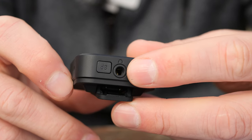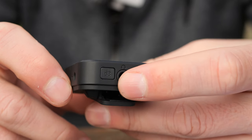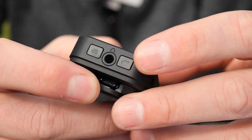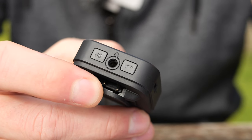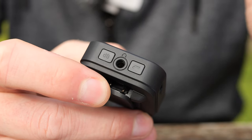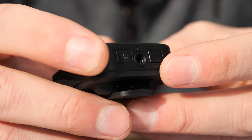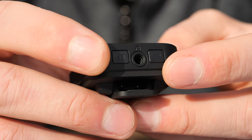Where they vary: the transmitter has a built-in omnidirectional microphone on the top and a mute button, which also doubles as the pairing button just in case it doesn't pair automatically. If you plan on getting a lavalier microphone, there is a 3.5mm audio input, so it does accept lavs — it just doesn't come with one in the box. The receiver has a 3.5mm audio output. On top, we get real-time headphone monitoring, which is fantastic — not all packs have this. There's also a high-pass filter to remove low end, and the dB button cycles through low, medium, and high output.